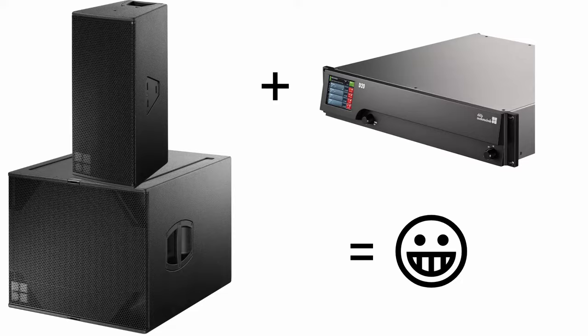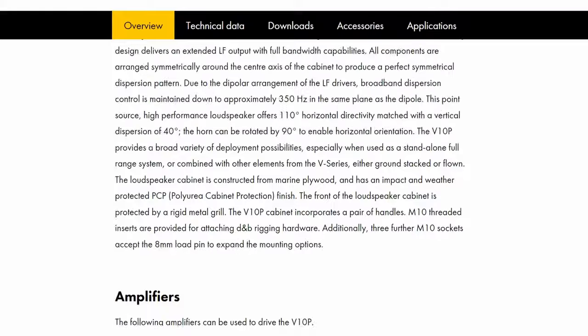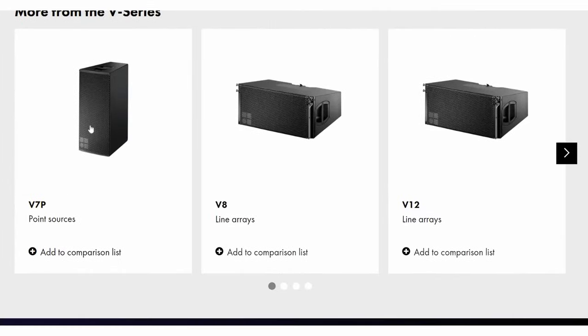Let's start with the scope of this video. This is about setting up the system — not rigging up microphones, connecting to the boxes, or doing alternative routing. I've done a video covering the mixer routing in depth before and I'll link to it below. If you're rigging up a new system, I highly recommend getting a complete system where all the parts complement each other, instead of piecing together mismatched gear. Quite often manufacturers build amplifiers specifically for their products with presets and processors in mind. Mixing brands of amplifiers and speakers can cause problems.